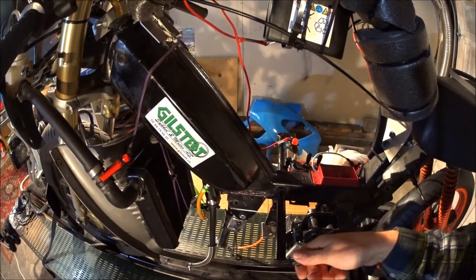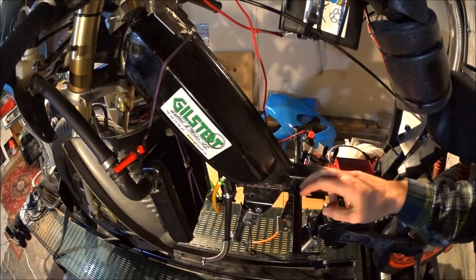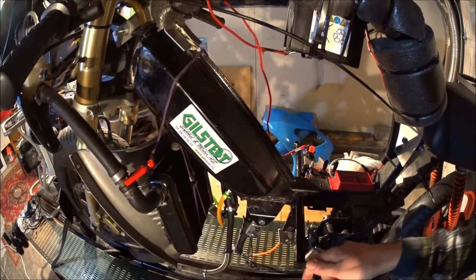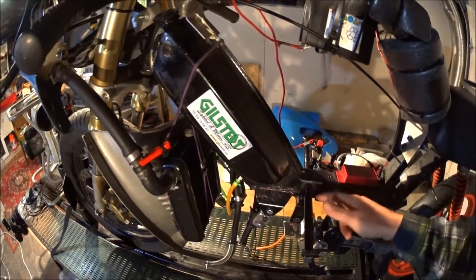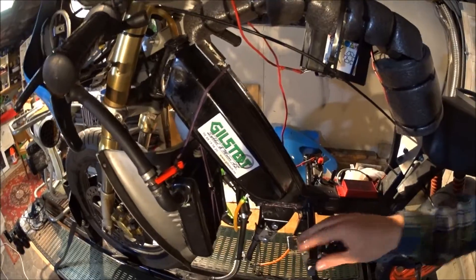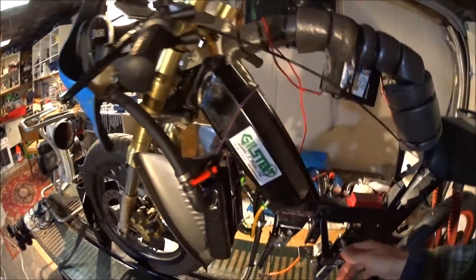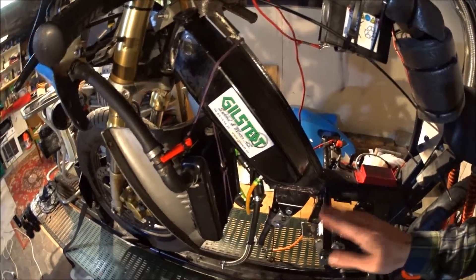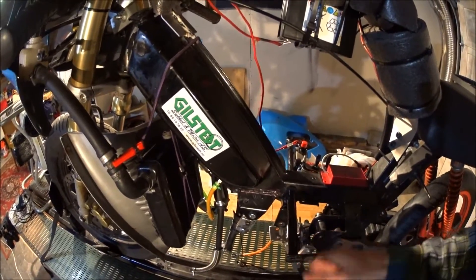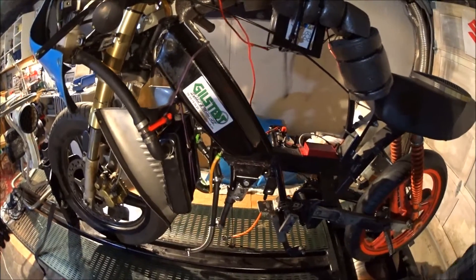Probably a bad weld — it looks like I have penetrated into this tubing but not into the frame. So my fault, really. But I have to fix it — just tack it up here so it will hold until I fabricate the new frame. I'll bring the welder over and some light and I will try to film it while welding — will be quite the experience for you.